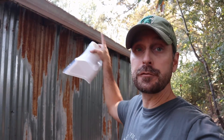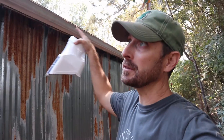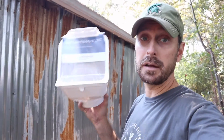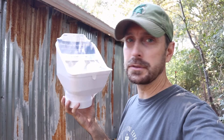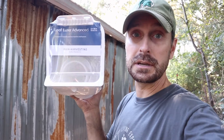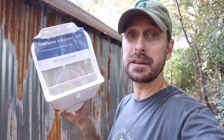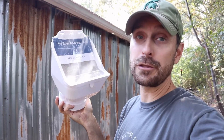I have some old leaf guards that I am going to put back on top of our gutter just as a first line of defense, because this area of the barn gets a lot of debris on it. But I also bought this leaf eater — this one happens to be by Blue Mountain Company; I'll put the links in the description below. This is a second line of defense and it doesn't let anything through it. It's got a fine mesh screen, so it doesn't let any leaves, twigs, chunks of bark, or whatever get through. In my case, I've actually got some old asphalt shingles up there with grit that comes down, and this screen is small enough that it won't let that through either.